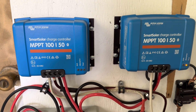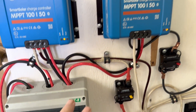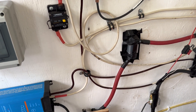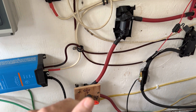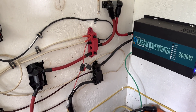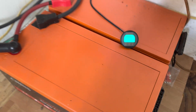So, sun coming in — 500 watts coming in here, 500 watt string coming in here. There's the solar panel isolator, a couple of breakers. There's the fuse — that's the one I had blown when that little wire came off the battery monitor. I've got a quick disconnect for when I want to come in and change or move something, which I don't do anymore really. I'm very happy with the way this is. It doesn't look as neat and organized as some of my other builds, but it's working so well. Early in the day and it's already at 95 percent full — couldn't be happier.